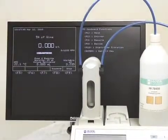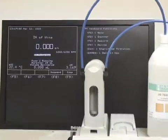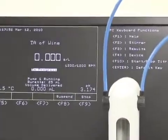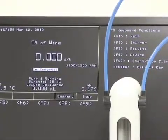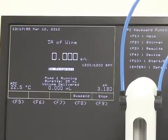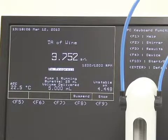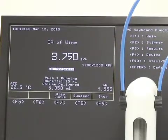The 901 is going to mix for 10 to 15 seconds, whatever is programmed into the test at that moment, and then it's going to start the titration. Total acidity does utilize the pre-titration dosing feature — we have it set at 3.5 mL, so it will begin the titration by adding 3.5 mL, bringing the pH up. We're actually set at 5 on this machine, and then we're going to work towards our endpoint of 8.2.